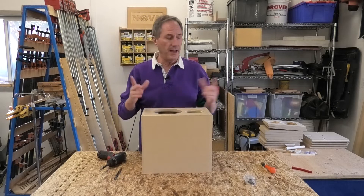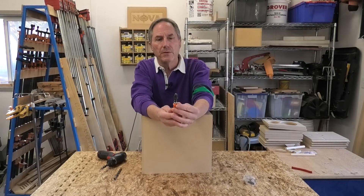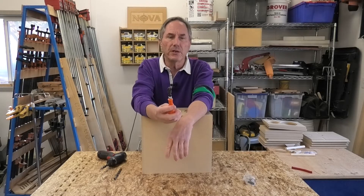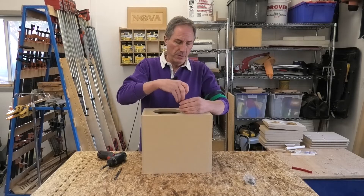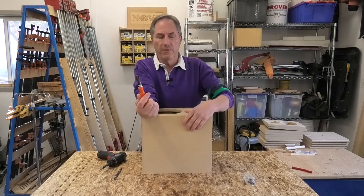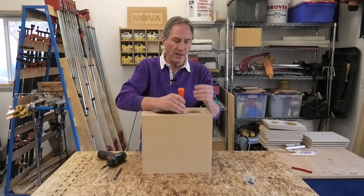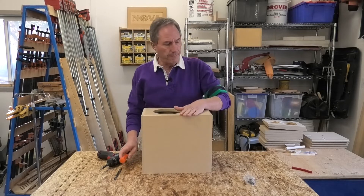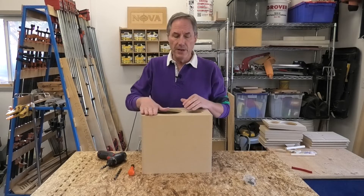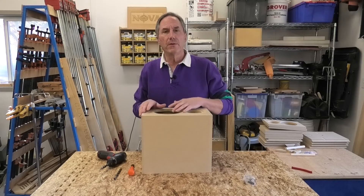To deal with volcanoes, you can do it a couple of ways. You can sand the top off, but ideally make a little recess — a little countersink — so that when you put the screw in for final assembly, you're not pulling that hump up again. I just take a drill bit, spin it a couple times to make a little countersink. You can also use an 82-degree countersink, which is a standard countersink for flathead screws. I do all the holes before any kind of finishing.